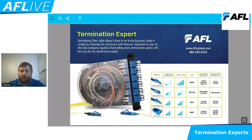And it would be very labor intensive. The application of that product would be very dependent on customer skill, your polishing method, and it would take quite a bit of time and effort to terminate one. Essentially, you would prep a fiber, you would put that fiber through the fiber optic ferrule, you would use some type of a scribe component to score that glass, you would pluck it, and then you would spend about 5 to 7 minutes polishing that in a figure eight style on some form of lapping paper. And it was very, very labor intensive.